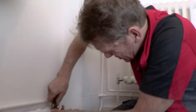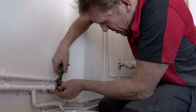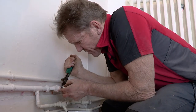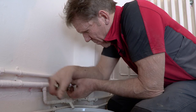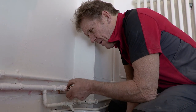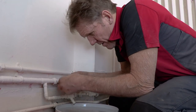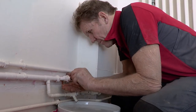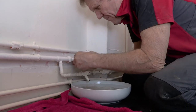You might think - if a bloke who's been doing it for years has so much trouble, what chance have you got? But that's the problem: it's been painted over. If you get rid of the paint, you might worry about this because the water's still live and we haven't turned it off out in the street. But what we've got there is a little stuffing box gland - it could be an O-ring in this one.